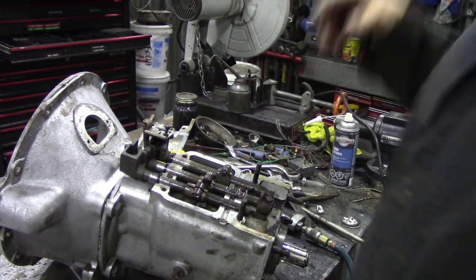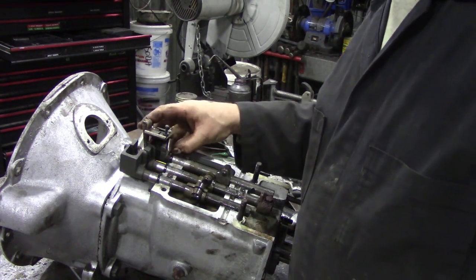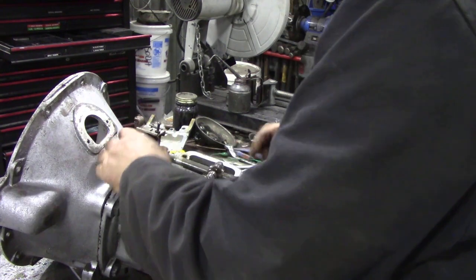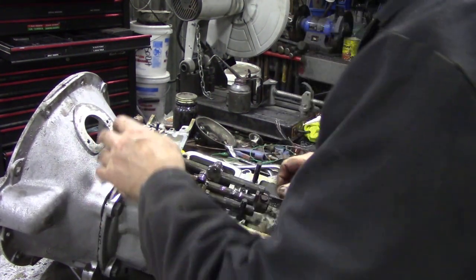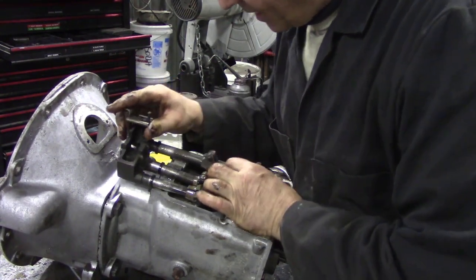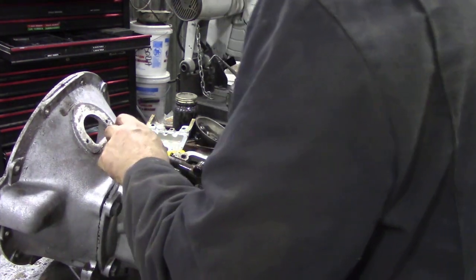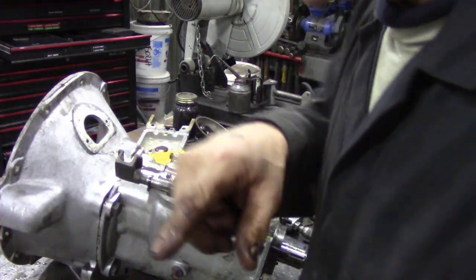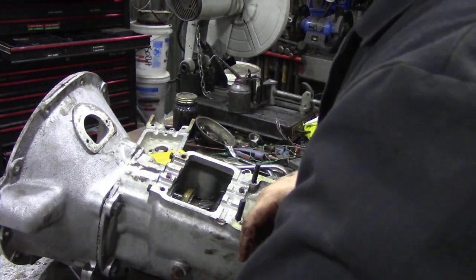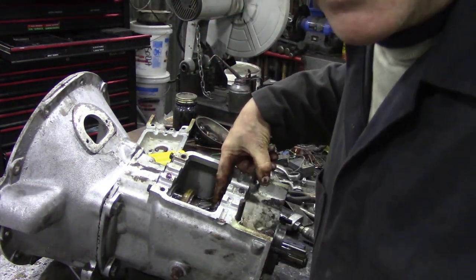Now, how do these come out? You'll notice that there's some oil seals on here - we have to replace those too. So we lift these out. There's a way to lift these out. Move these to one side. And then twist and turn, you can get the selectors out. You don't have to undo these - pull the third and fourth back, and there you go. That's those. Now we can have a look inside. There's some geary things in there.